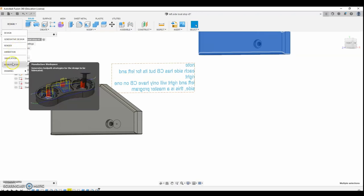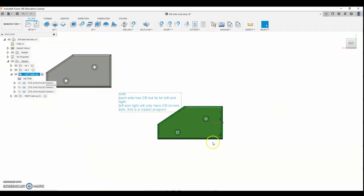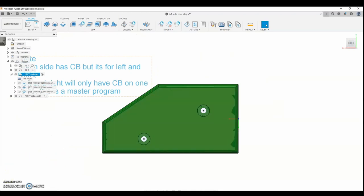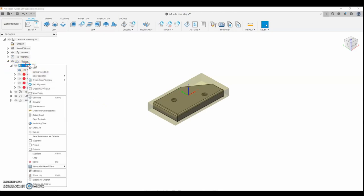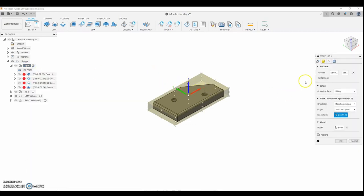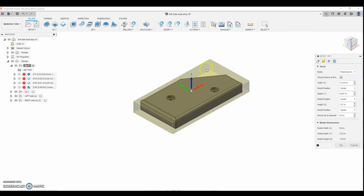Now we're jumping into the CAM. I'll show you the first block I made and walk through that process. I have my different ops here — let's go over to Setup. My stock was actually one big sheet that I cut down the center, so the edges are oversized. That's why I had to slot it — my machine travel wouldn't allow me to machine the whole outside, and slotting is smarter because it takes less time. With plastic it was really nice.